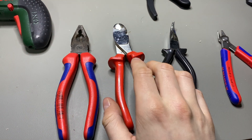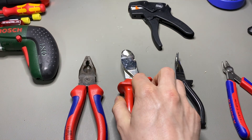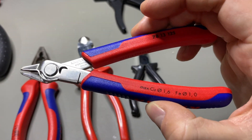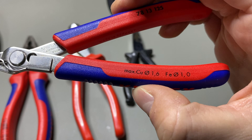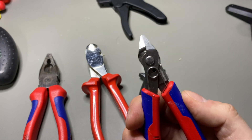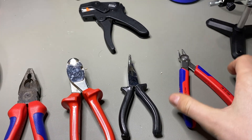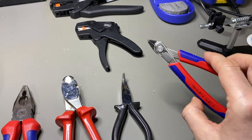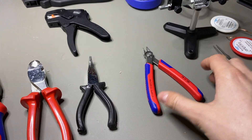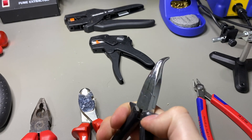You need some good wire cutters. For big wires use a sturdy one, and for small wires use an electronic side wire cutter — the diameter should not exceed 1.6mm of copper wire. Trust me, I ruined one of those in my early days at a company. They're about 50 bucks and I destroyed one by cutting big wires with it. The guy got very angry.